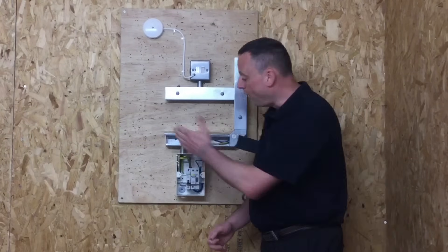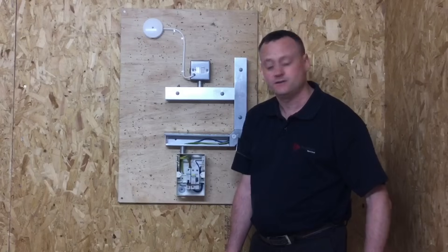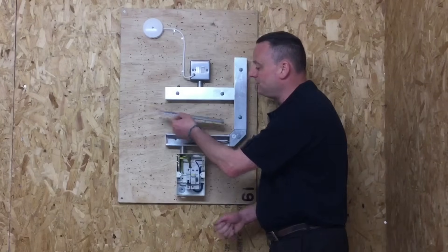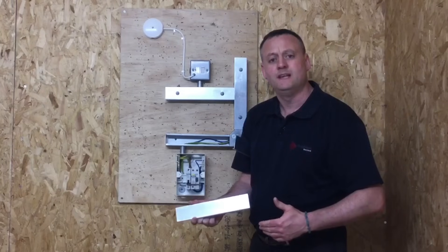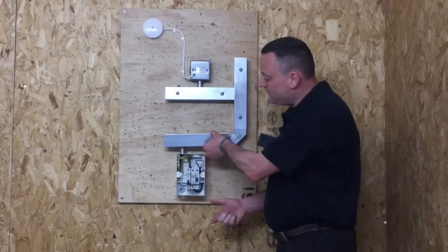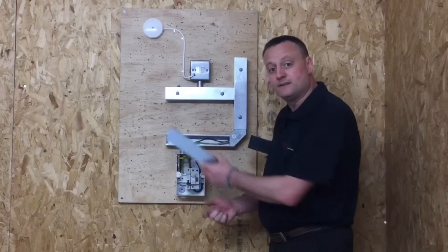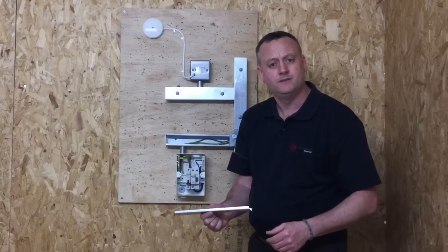We're always going to work with the lower piece above the consumer unit, whether it's level one or level two. First, you're required to make sure the lid is the correct length — no point putting the turnbuckle clips in and then discovering it's a little bit too short. So confirm the lid is the correct length and deburr at both ends before we move on to put the turnbuckle clips in.